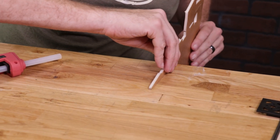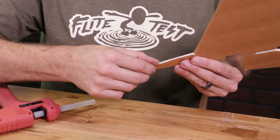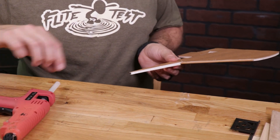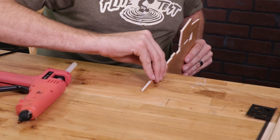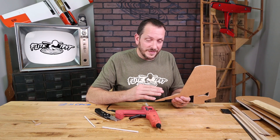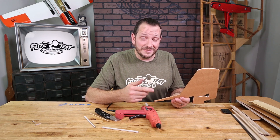I like to do a practice fold to 90 degrees first, and once we're happy with that, put a very thin bead of glue down right over the foam, bring it back down to the table, fold it up 90 degrees, and slide this away while giving tension on the paper and pressing it down. These two fold-overs are going to make the tail last much longer, especially if we happen to flip it over or take some abuse during years of flight.